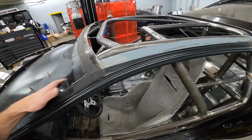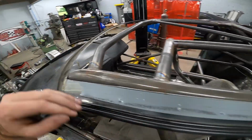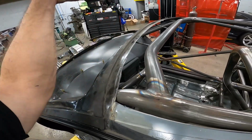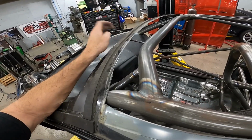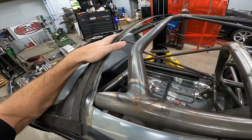I will say, for you guys cutting the top off, doing the carbon tops like he's doing on this car, we put some little stringers out to this front band, because that thing, you can just push it with your arm and bend it. I mean, there's no support at all when you cut everything out. So you need to have something there to hold the wind, or it'll be doing like that going down the track.